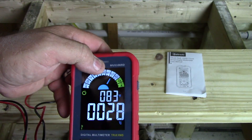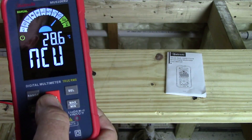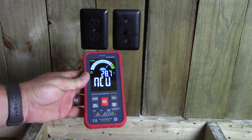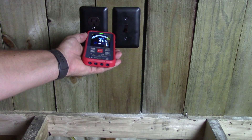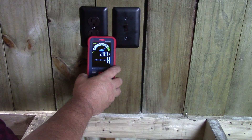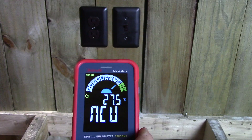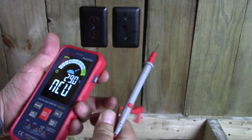There's a temperature check with Celsius and Fahrenheit. It also has NCV — non-contact voltage — where you can test voltage on a receptacle without a probe. There's a receptacle right here and I can show you. You can see it has an 'L' on it — that's low voltage. When it's on high it beeps rapidly, showing high voltage. When it's on low you're probably not close enough to the post and it shows an 'L' for low.